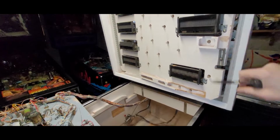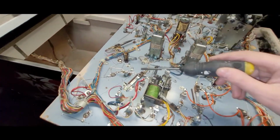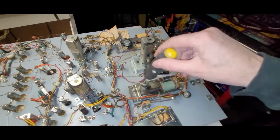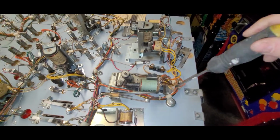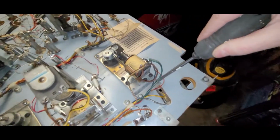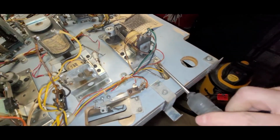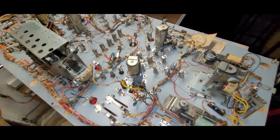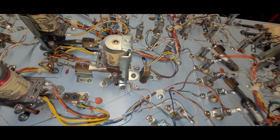On the playfield, I took my Phillips screwdriver and I tightened every single Phillips on every switch, on every mechanism. These guys, flipper plates, switches, slingshots, rollovers, targets, you name it. Every Phillips. I think I've gotten every single Phillips. This screw that was there was too small, wasn't catching anything, so I got a bigger screw. This here, I thought there was a screw missing, and oh, I have now concluded there is a screw missing. At first I thought it was just this cavity and they couldn't put a screw there, but it looks like the cavity doesn't extend that far, so got me another screw to install there. I added a nut to this post that was missing. Tighten these guys up, the center posts.